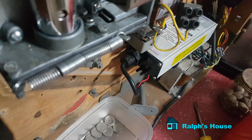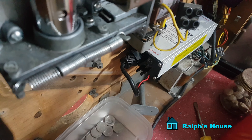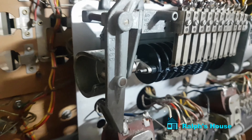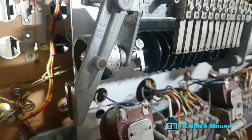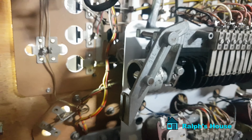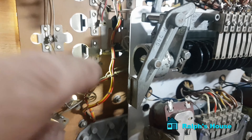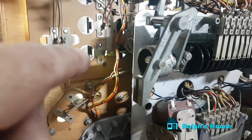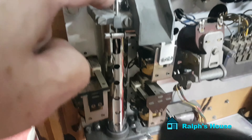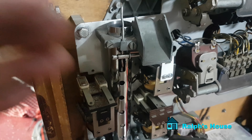I'll go around and give all the contacts a bit of a clean, and then we'll start putting the coin mechanism in, which will be rather nice. If you notice when the cam starts up as it's dropping the ball - do you see the arm came out? The reason it does that is because when you put 20p in, the coin mechanism sits here, 20p is sitting in the coin mechanism, and the only thing that makes it drop is this arm coming across and pushing a lever on the coin mechanism. Then it either drops into the payout shoot or goes down here into a coin catcher on the very back of the machine, which I shall put on as the last job.